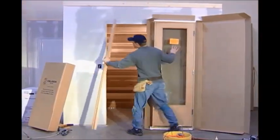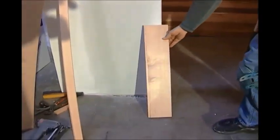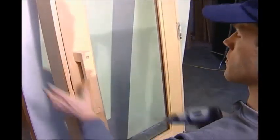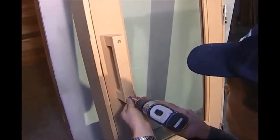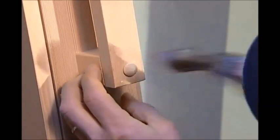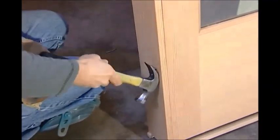Now the entire room should be paneled. It's time to install the door. When opening the door box, you'll notice the door handle on the back side of the door is attached. The door sill is wrapped in bubble wrap — take it out and set aside. Remove the other door handle from the shrink wrap and attach it to the front of the door with the screws provided. Center the handle on the roller catch and off-center slightly from the door handle on the other side. Insert the four wood buttons to the screw holes and tap in place with a hammer. Remove the two partially exposed nails on the outside of the door jamb that were used in shipping.